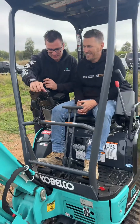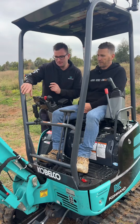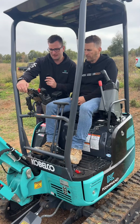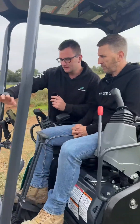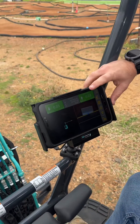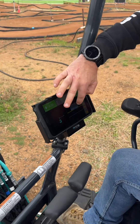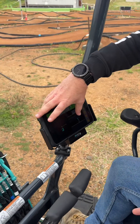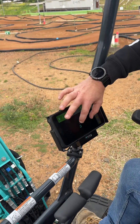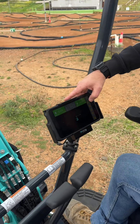It's all fired up with corrections. At the moment you're on a flat surface design. Up the top you have all your heights — you can check your northing, easting, and height. You've got your machine view and different views; if you swipe across you can zoom in and out. On a big design you can shuffle across to see where your machine is.